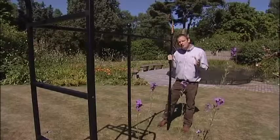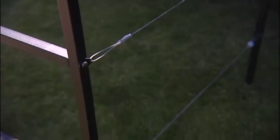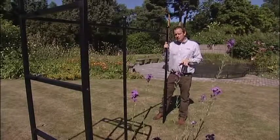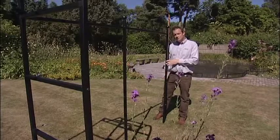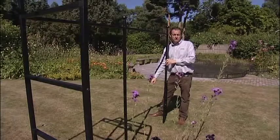How do you go about installing an arch fence system? It's quite simple. You'd either go straight into the ground if your ground conditions are quite firm, or if you've got soft ground you may want to use the optional brace available for the upright — simply a 45-degree brace that goes from the upright down to the ground and is anchored with a pin.